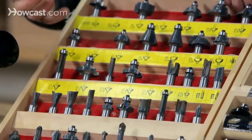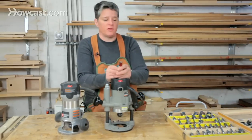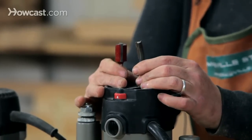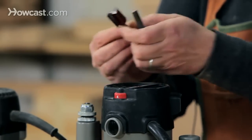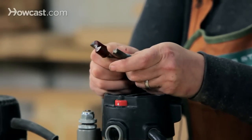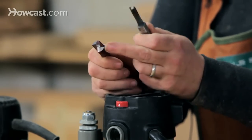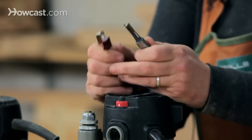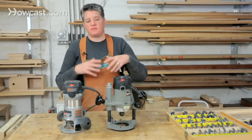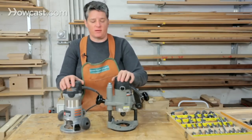Imagine we're taking out three-quarters of an inch of material versus a quarter inch of material — the router is doing a lot more work to remove more material. Also, the bit is spinning faster at the outside of a larger circle, so that's the reason we slow down the speed for bigger bits. Usually the router bit package will tell you the optimum speed to operate it at, so you don't have to memorize that for every router bit.